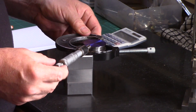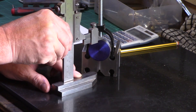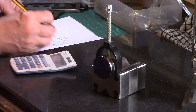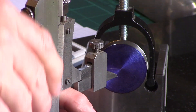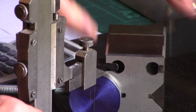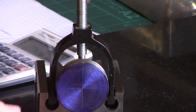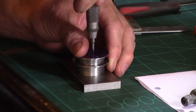This was prepared for marking out and clamped in a V-block and measurements were double checked. Then the centre line was marked and zeroed for reference to the offset. The offset was then set on the scribe and the position marked out on the job. The vertical centre line was then scribed to complete the marking out.